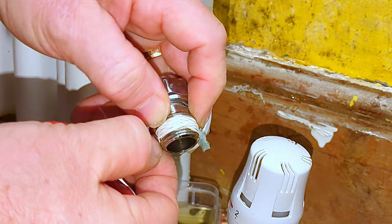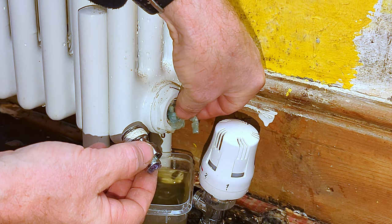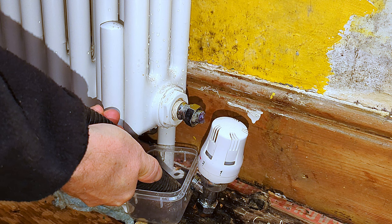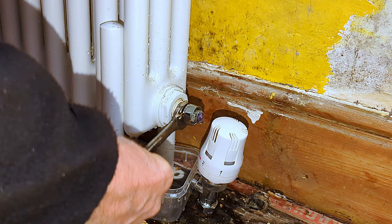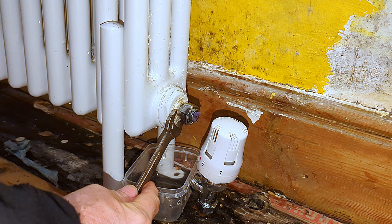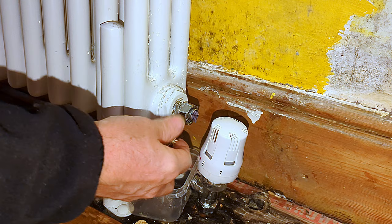That's because I know this spigot is going to be a little bit loose inside the radiator and I want to fill in those gaps — I've probably wrapped it around between 10 and 15 times. Just before I put it in the radiator, I'm putting a bit of paper up inside the hole so I don't have water continuously running out. I carefully remove that paper, making sure it all comes out, then pop the tail into the radiator and screw it up. I always have my water vacuum to hand — if you don't have one, make sure you've got plenty of towels and buckets. I now tighten the tail up into the radiator — I want it really nice and tight. This homeowner had this job done by another plumber and eight months later all the connections were leaking.